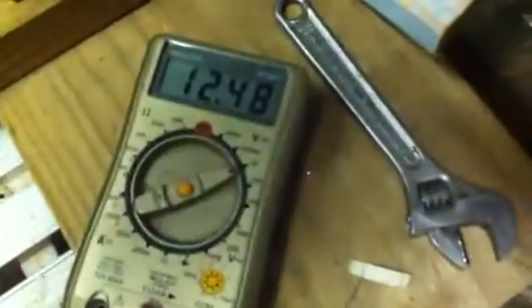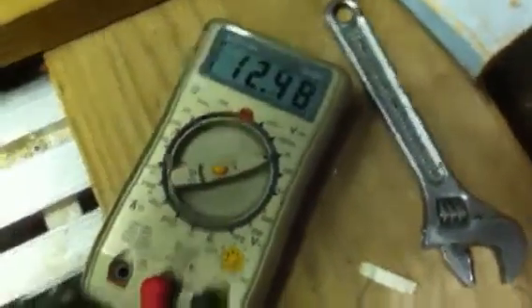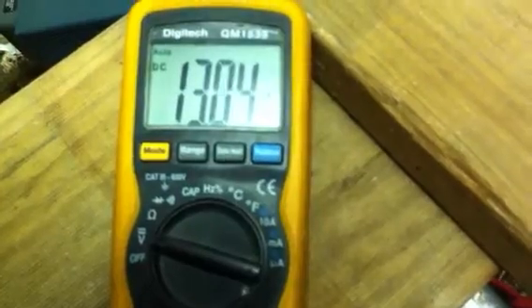Yeah, it's kind of running well. You can see the run battery has actually gained a couple of hundredths of a volt. Look at that meter — it moves around a little bit because my wheel's not quite straight. You can see the dump voltage — that's dumping about every second or so. And you can see the run batteries now. The charge battery is up there now.